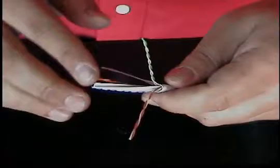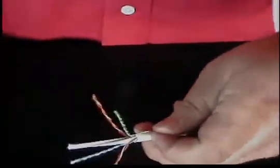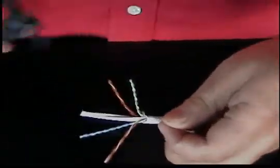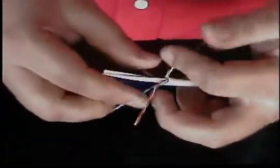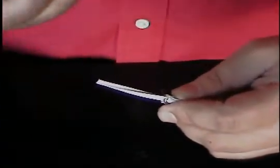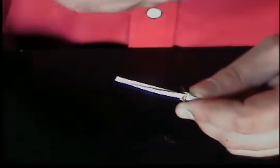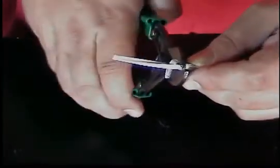Let's go ahead and get started. I've got a piece of cable here — this is Cat 6 cable. Let's go ahead and strip a piece off. As you can tell, the conductors are tightly wound a little more than Cat 5. We've got a pull string here, we're going to go ahead and just cut that off. Usually when you find a good quality Cat 6 cable, you're going to get a nice separator here. That's going to definitely help out with your test results when you put your Fluke tester on there for the near end and far end crosstalk. So we're just going to go ahead and cut that off.